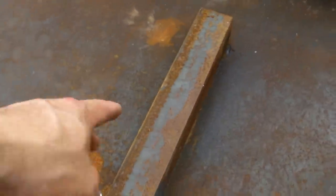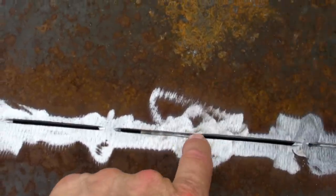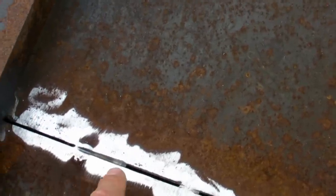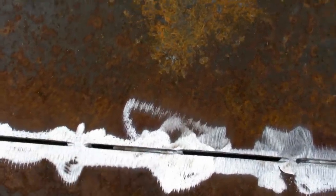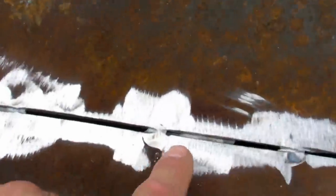This is the side we started with — it has the Strong Backs welded down to it, and we started with tacks on this side. Then we flipped it to the other side, did surface grinding on that side, and did the back gouge through it. You can see the welds on the other side — that one's almost an inch and a half; there was actually a tack in there. Now we've surface-ground this side, our tacks got ground down, and then we back gouge. Kay does the surface grinding and I do the back gouging. That way we get down to clean steel — if there's any inclusions we see in there, we keep going. If it's got a little pit we come back a little deeper. Once it looks like good clean steel, that's the whole idea.